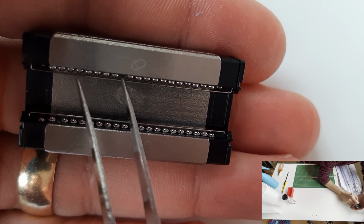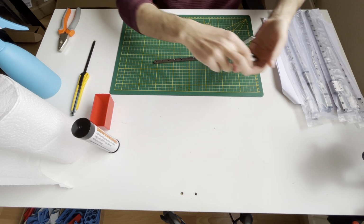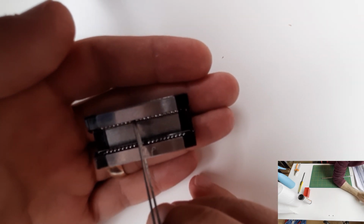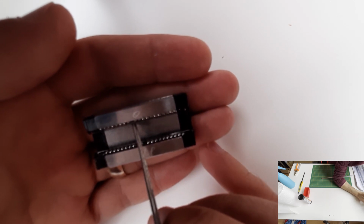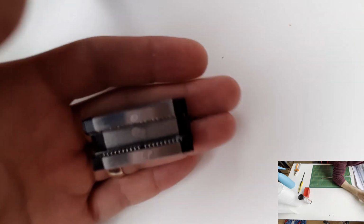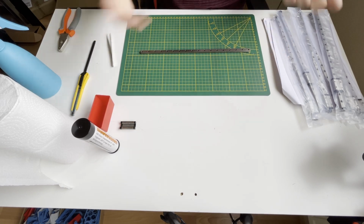By the way, there is a gap between the balls in total, I mean, like this. It should be there, don't worry about that. Don't assume something is missing, it's like a 1 or 2 ball empty space. If it is more than that, maybe you should buy spares and put them here. For putting them in, I'm creating the space for the new ball like this, putting the ball on top with the tweezers and gently pressing it. This is the flexible wire. If you gently press it, it will sit in its place and you will fill the gap. But like I said, there should be a 1 ball gap for each line. So this is okay. I will put this in a safe space. Since these are too small, you can easily lose them, so you need to get a spare one.